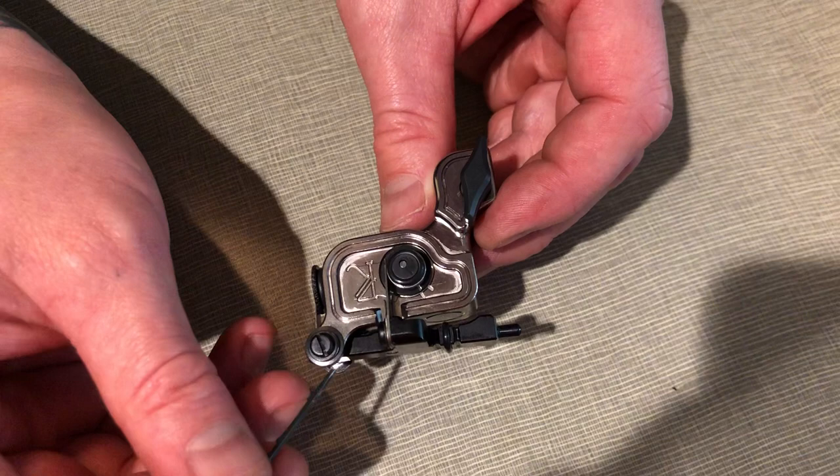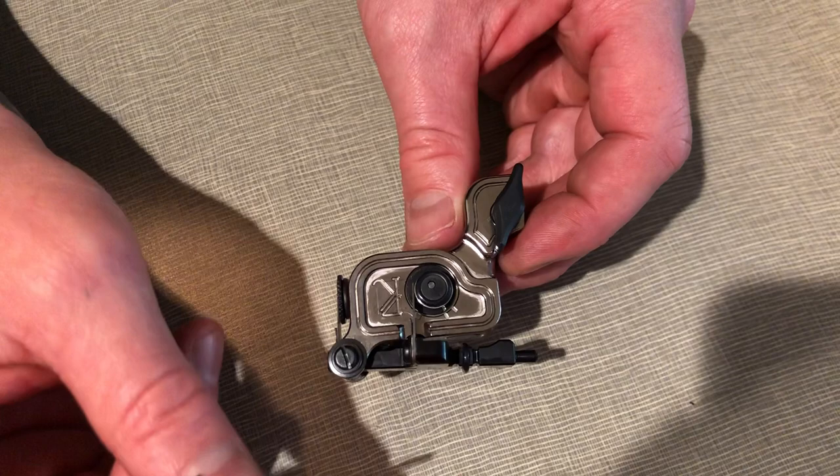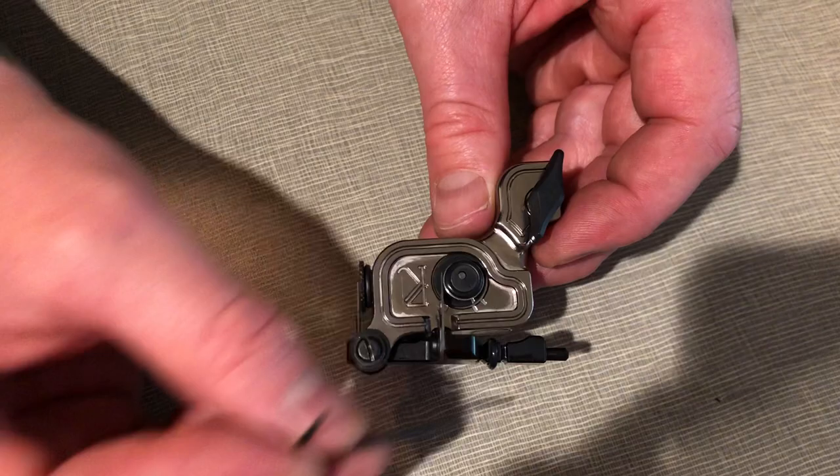the o-ring will hit and your machine will still kind of run — it'll just lose its snap a little bit and it'll be quieter. Some people actually like to back out the impact screw and just run off the o-ring, and you can add a couple more o-rings. They are 7/32nds inside diameter o-rings by 1/16th inch thick. I recommend EPDM o-rings — I usually send a couple extras with the machine.